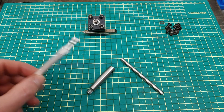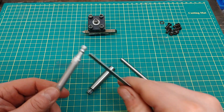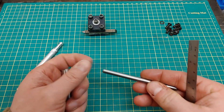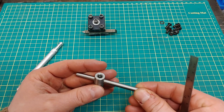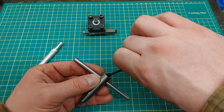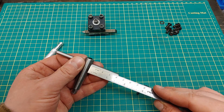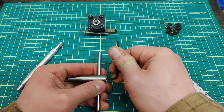Now we've got all of our test pieces — our pawns — ran another one just to see how it turned out, and it did pretty good. This handle with nice rounded-over ends drops in there and uses an M6 set screw to hold everything in place. We can check with the ruler and get our length nicely set and lock it down.